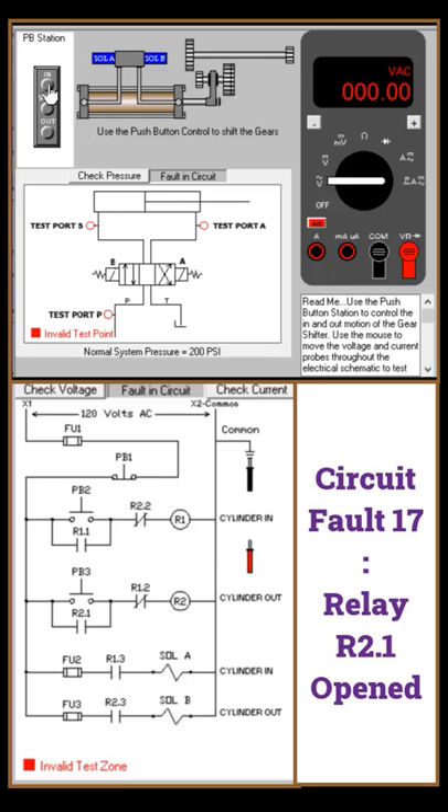Press the stop button, then press the in button, then press the out button. The arms only move out a bit — that means something is wrong with the out cylinder, the out section.